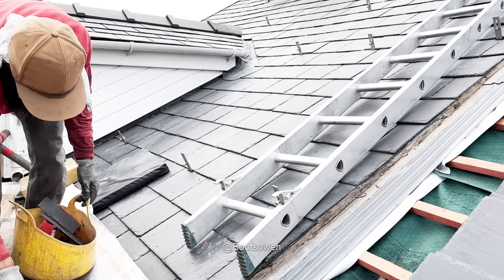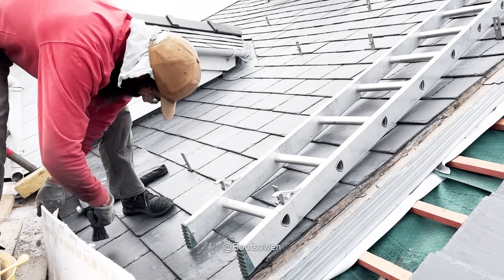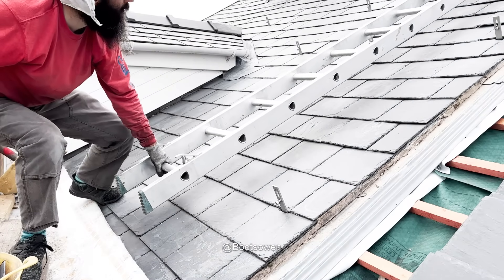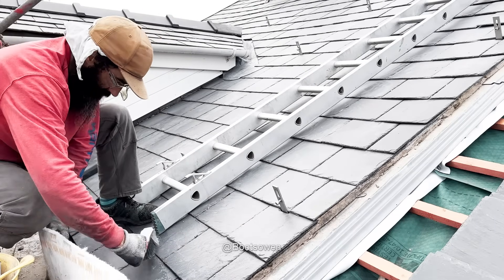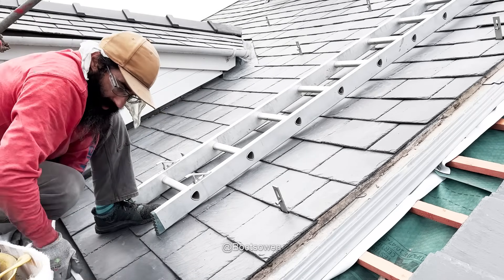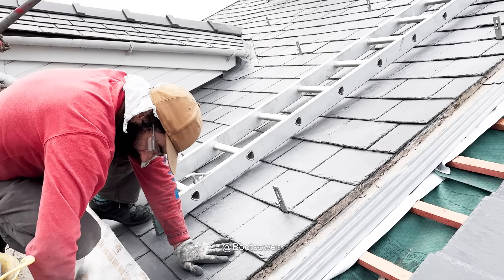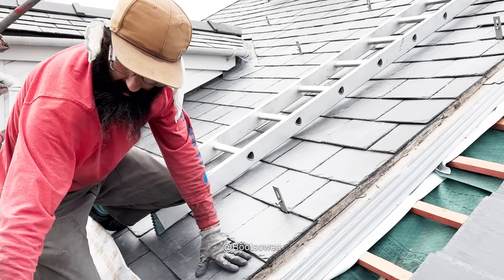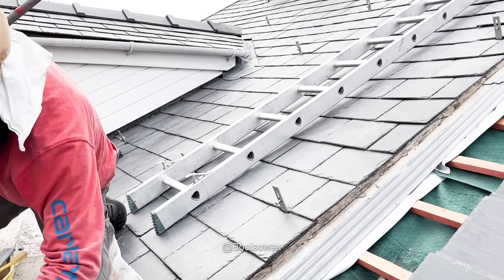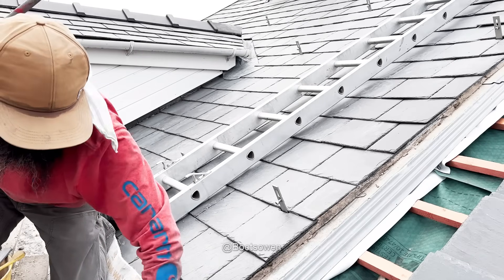I just tidy up the site and I'm going to go downstairs and have some dinner. Thanks for watching — like, subscribe, become a member, give me some of your money if this video has been helpful and saved you a day rate on a roofer. I had a safe day — I was quite happy working on the cat ladder for the higher-up ones. I put a cushion under the cat ladder and that spreads the load so it's not just pinpointing at the foot of the ladder. I was pleased with it — got all the hooks in line. The only tip I'd add: get your first two hooks in, then when fitting the last one put the bar across and use a line to get the third hook right, or do the two edge ones and then get the middle right, because some of the courses of slates on my roof weren't exactly perfect. Tidy up and have a good evening — thanks for watching.